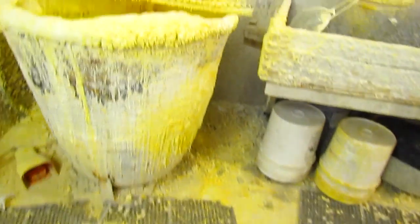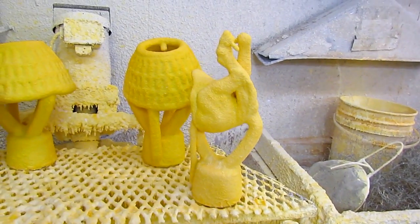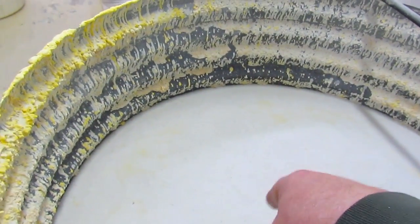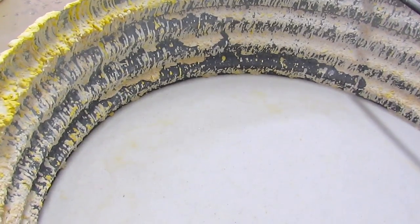There's more of the sprues there too. That's the back end of one of the horses. And this is the slurry they dip it into. Then this is the sand that they put it in — they have air pumped through this that makes it like liquid, so they can just drop the wax in it.